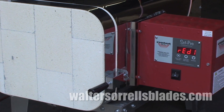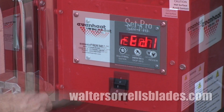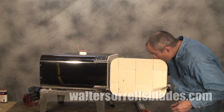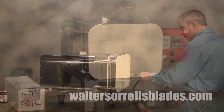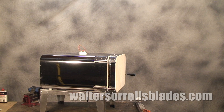Higher grade heat treating ovens all come with digital temperature controls. Most of them are programmable; some allow very complex programming, but this is not necessary for the average knife maker. Some of the lower end models don't come with digital controls, but you have to have some kind of temperature control — otherwise there's no point in using a heat treating oven at all.